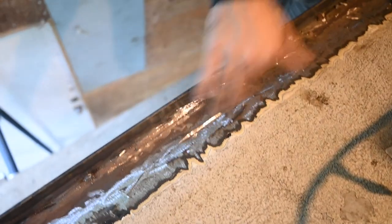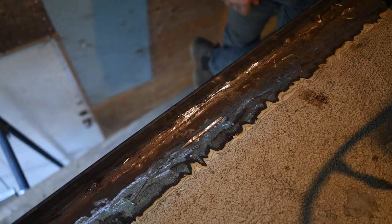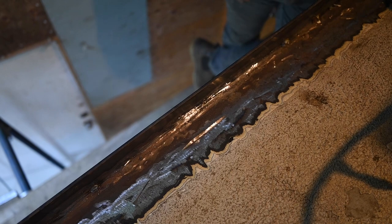Yeah, so this morning we just need to prep for welding the bulwarks on. And we have some spots where I found porosity while grinding, and that's the point of grinding. Well, not the whole point, but anyways, I've V'd those out and we'll weld those up.